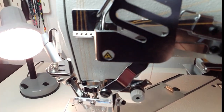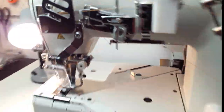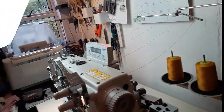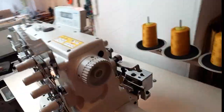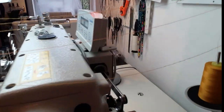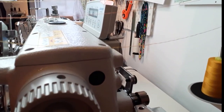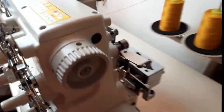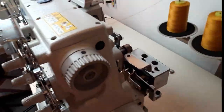The needle thread tension is always a bit tighter than the looper's tension or the spreader's tension. The tension should be tight enough to form a balanced stitch but not any tighter. A well-set machine will need very few tension adjustments. Always make sure there are no obstacles in the threading path and that the thread moves freely and doesn't get caught anywhere.